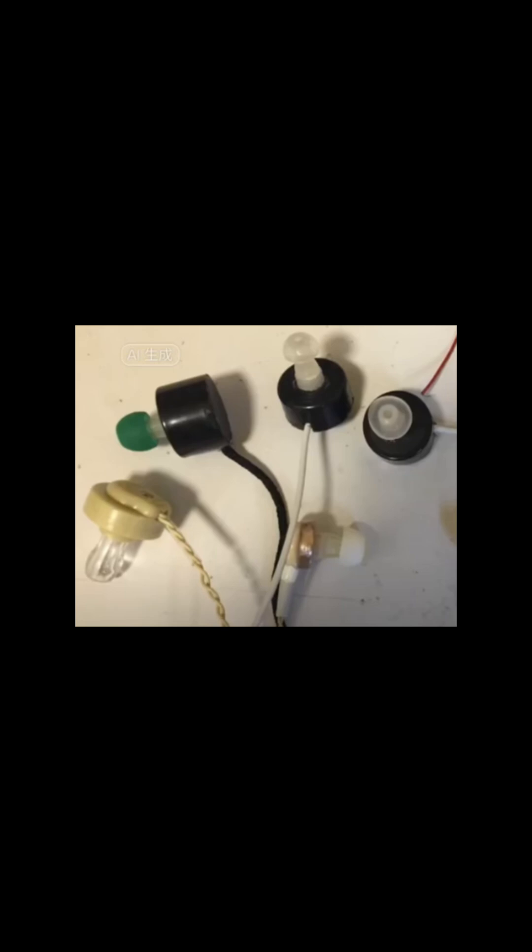You can try the following headphones. Crystal earbuds are made of piezoelectric buzzers with an impedance of 10 kOhms. Since this is a capacitive earbud, it needs a DC path to release the charges each time before it will be ready to make the next sound. A 500 kOhm resistor or a transformer of multiple henries will do the trick.